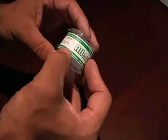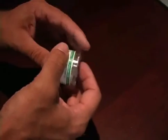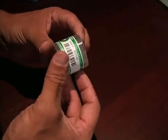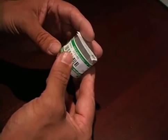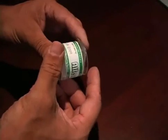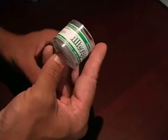And let's see, if there's a lot of excessive dust and cleaning or sweeping going on on the inside, we can go down to 1 to 3 minutes. Inner wall sampling is about 5 minutes. And you store these between 50 and 80 degrees Fahrenheit, and don't use these in temperatures below 32 degrees Fahrenheit.